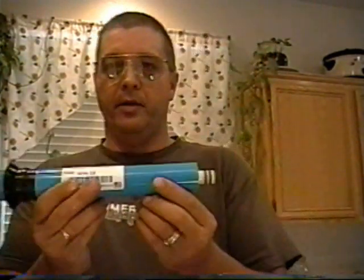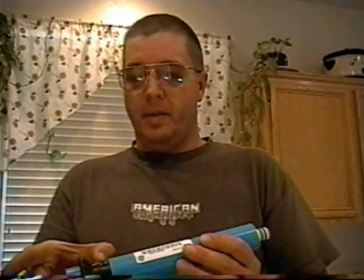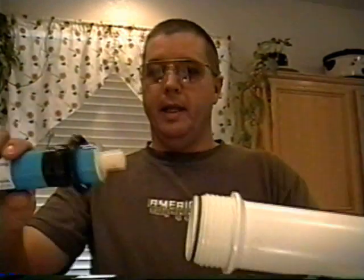All you need to do is just take a pair of pliers, grab the plastic, and pull it out. Now, to install the new membrane, let me explain the membrane itself first. This is a standard reverse osmosis membrane — this one happens to be made by GE Osmonix. Filmtech makes an excellent membrane also; they're both standard size and dimensions. You'll notice on one end there is a rubber ring — this is the brine seal. This is what keeps the water from going around the membrane and forces it to go through the membrane. On the other end, you'll see this one has two O-rings; some only have one. The important thing to remember is the O-ring end goes in first on these standard systems.